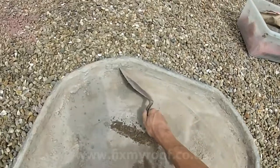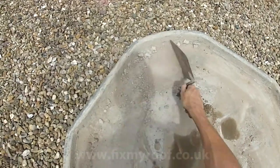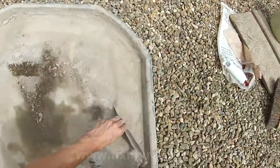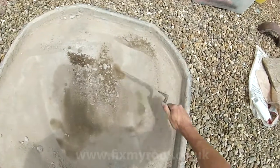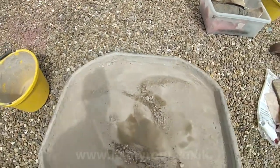The first place I like to start is with a bricklayer's trowel or similar dull-bladed object. It allows me to get into all the nooks and crannies very easily without scraping it and creating damage. Because the mortar hasn't been allowed to cure on the spot for any great length of time, it chips off easily. Obviously, if you're scraping any sort of cement or dust like this, wear a mask and try to work upwind.